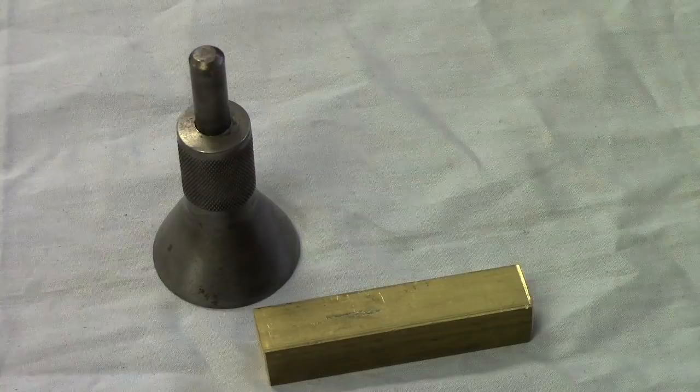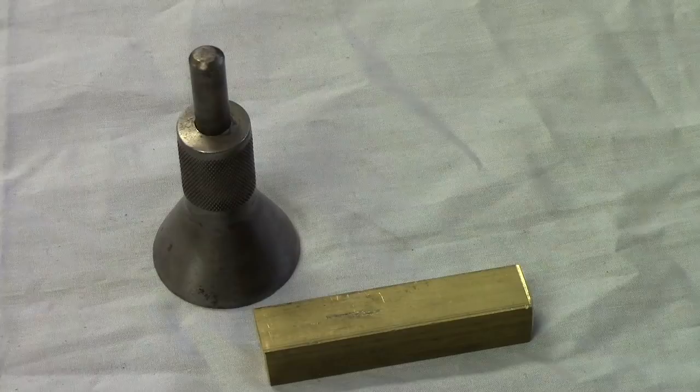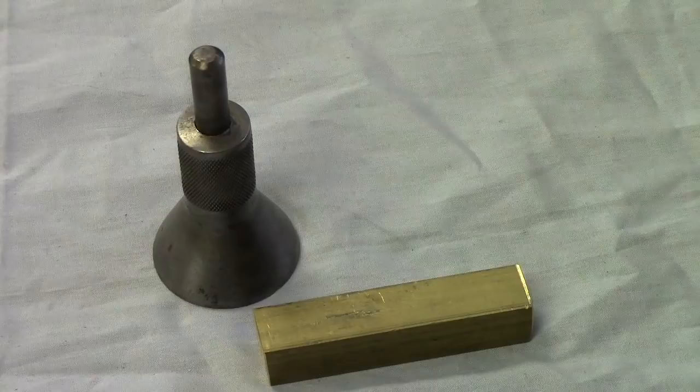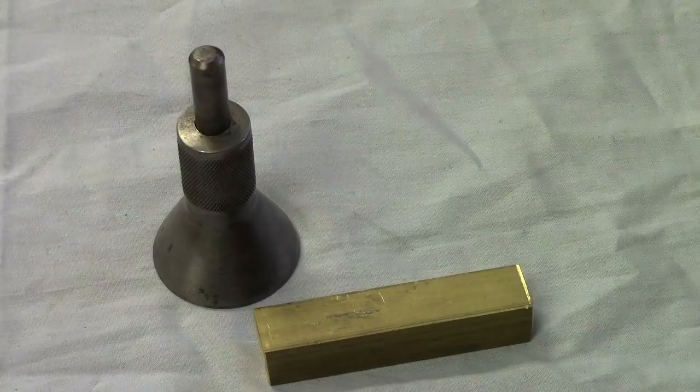quick in the ballpark. In my lathe, I've got a dial indicator on the cross feed, so once I get the stock in there, I've got a dial indicator automatically set up so I can fine-tune it at that point. But typically I found that if you center punch it and align your jaws so the dead center or the live center in the tailstock aligns to that dimple, you're going to be within 5 or 6 thousandths. And I know that's a lot, but it's fast and quick. So we can add that to the 10,001 videos on how to adjust a four-jaw chuck. If I have time, we'll video this, but I think it's pretty self-explanatory in case we don't get to it.